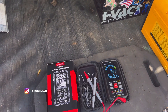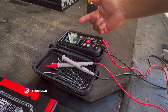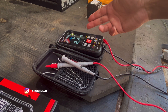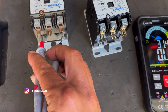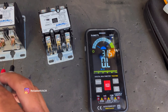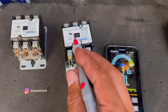I'm going to show it in the field and use it for a few days. Primarily what you're going to use this for is anything dealing with voltage, continuity, and microfarads. You can also do temperature. It is a true RMS meter. Just to show real quick — the bad one, if you want to check resistance, it has no resistance anymore. That was a bad contactor on the coil. This is a brand new one, and if you check it, it's seven and a half ohms — bad versus good contactor.